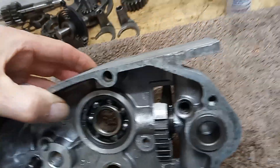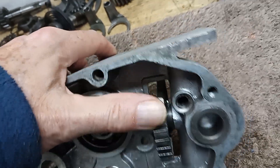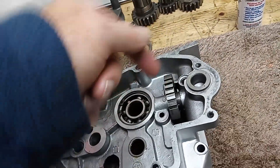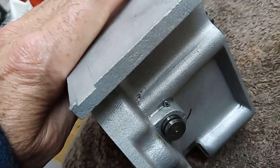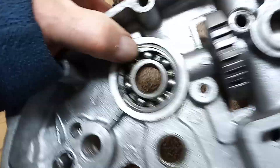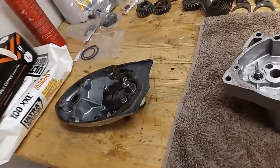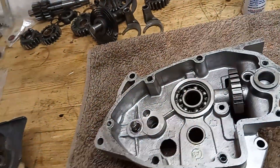The quadrant is now in place, held with a split pin — it can only go in one way around because if it's the wrong way the holes won't line up with the pin. There's the back with the second split pin in, and that extra groove we're not entirely sure about — it probably just helps you pull the pin out. So that's both the inner and outer casing now prepped, and we can get on and start rebuilding the gearbox.